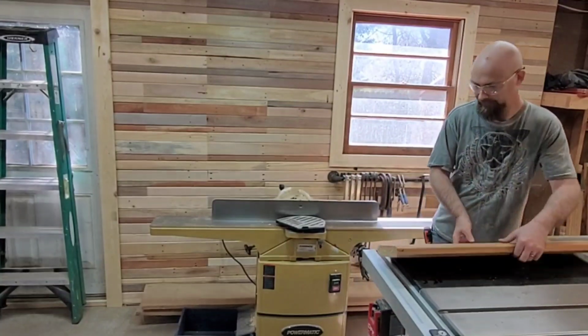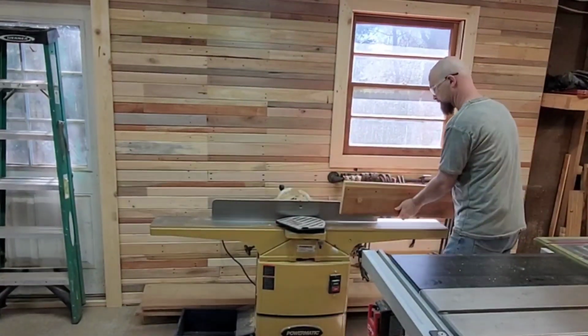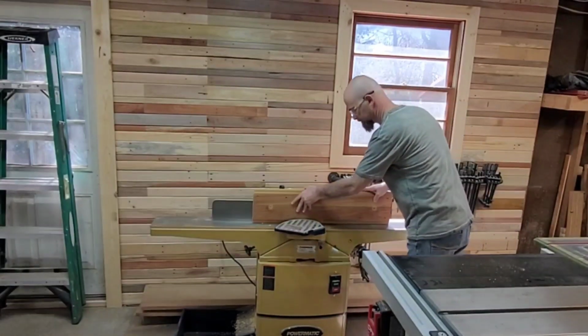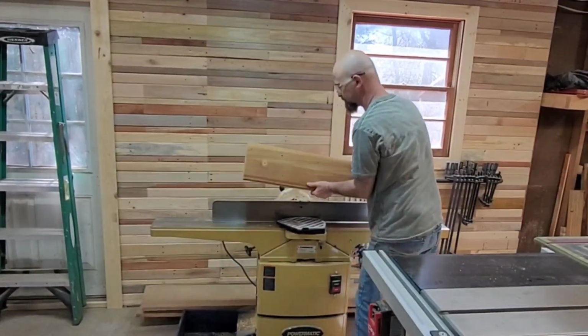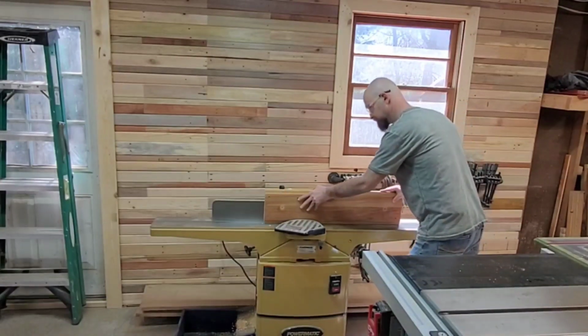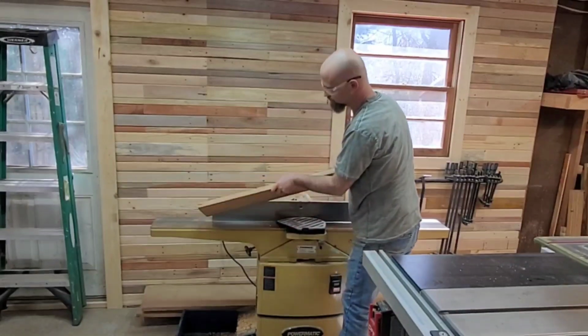I want this to be nice and flush with the back of this pipe clamp rack. So I went over to the jointer and made sure to joint one side. Now this side is, at the moment, going to be the back. So I want everything nice and square and straight. This will also give me a nice reference edge when I put it on the table saw